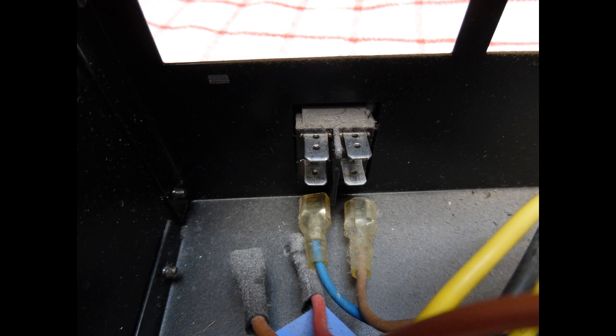The first check was the protection fuse at the rear of the amplifier — a normal continuity check showed open circuit. Before condemning the toroidal transformer, I measured the primary directly with the top cover removed, and there was resistance, so it was fine. I also verified the fuse carrier contacts were good, and continuity from the three-pin plug through to one side of the fuse and neutral showed no broken wire or damaged fuse inside the plug.